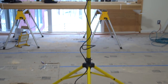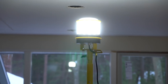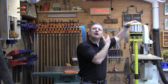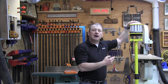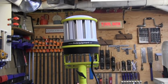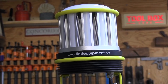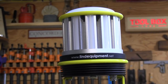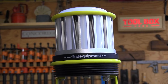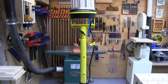The Beacon 360 Trek is constructed with a heavy-duty cast aluminum housing and a polycarbonate frame around the LEDs acting as a waterproof lens. It is six inches in diameter, 14 inches tall, and the head weighs 10 pounds. It has a 14-and-a-half-foot cord, which on our job sites gets us to the center of just about any room we're working on.